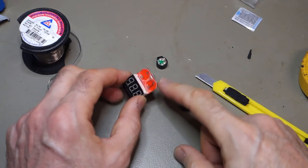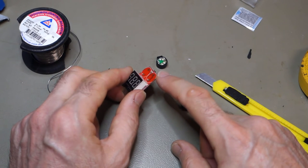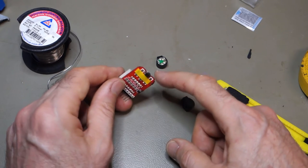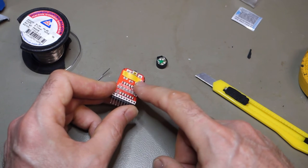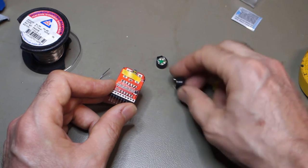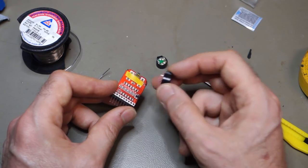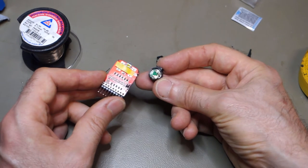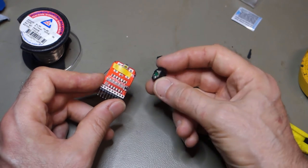Okay, that cleaned up quite nicely. I've taken all the solder out of the holes, wiped it down with acetone to remove the solder flux. Now, so they have to go on the back here. I've popped a bit of yellow insulation tape. There's just a few components. It looks like the transistors that actually drive these little piezo speaker things, buzzers. So I just did that to ensure they don't short out with any of these pins. There's not much protection on the back of these buzzers.